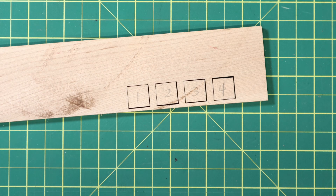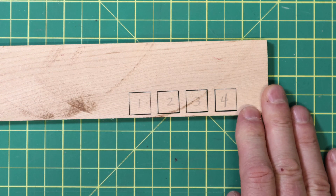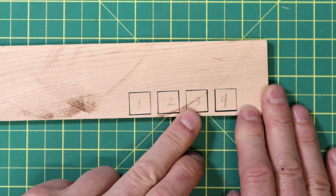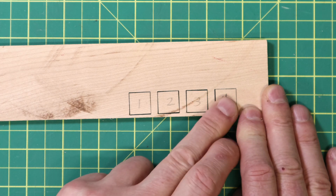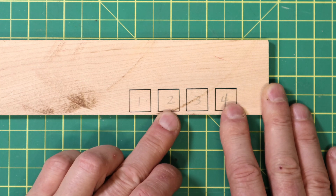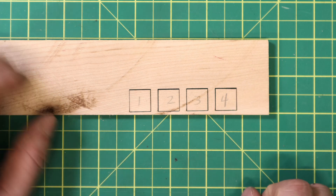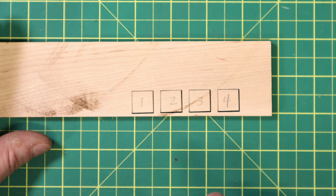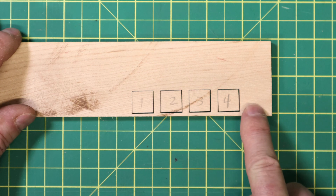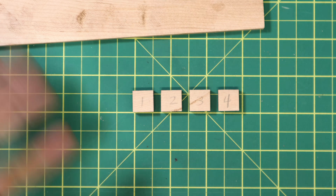For the final test I did my quarter inch maple cutting test with one pass, two pass, three pass, and four pass. By comparison, the P20 was able to cut through at three and four passes — and I believe two pass was there as well. The D1 Pro could cut through with three and four passes. With this 35 watt, the intent was to see how many passes it takes with the same power, and it cut through every single attempt, even on the first pass. Cutting is amazing with this laser, and it's a good engraver as well.